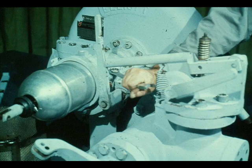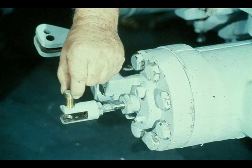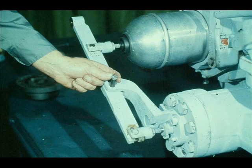As mentioned earlier in the course, the outboard bearing cap could not be replaced until the governor hood was reinstalled. Now that the hood is back in place, the bearing cap can be installed and tightened down. The grommet seal, already in place on the spindle, should now be snapped into the hood. The first step in reassembling the linkage is to replace the pin in the governor valve stem connection. Then slide the governor lever over the pin. Now the workman aligns the hole in the governor lever with the hole in the fulcrum bracket and installs the pin.